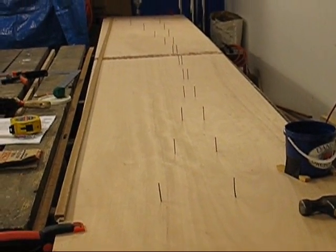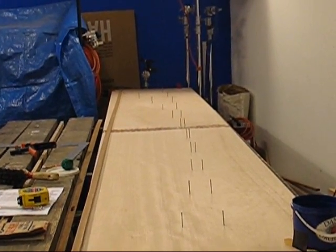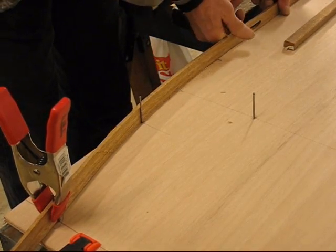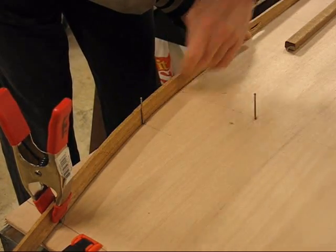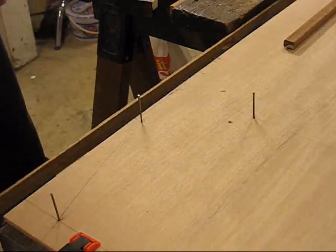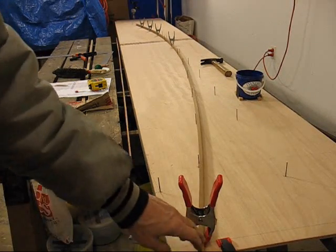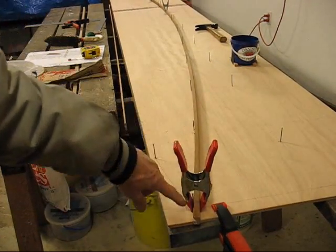You can just see how those things march off into the distance — that's pretty much the outline of the boat. So let me bring the batten in and we'll form this line right in here. Everything this way is a straight line so you kind of hold it up, and then just lock in that arc. I've got my batten installed. You want to have a little bit extra beyond this in order to maintain the correct curve here.